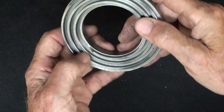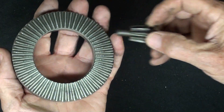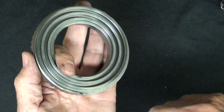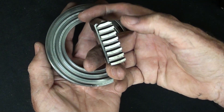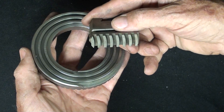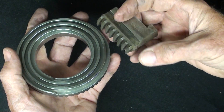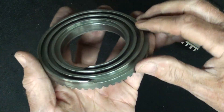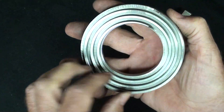This is a very expensive part to make because it's a gear on one side and it has thread teeth on the other side. These miter gears or bevel gears fit in there like that, as you saw already. But this is why we call a three-jaw chuck, or a six-jaw chuck, a scroll chuck — this is a scroll, kind of like a spiral, but it's a thread in a scroll shape. Notice that the threads on the jaws match up. You can understand why you have to have reverse jaws, because you can't reverse the jaws and expect them to go into the scroll. These are hardened — a very, very expensive part, made to tight tolerances.